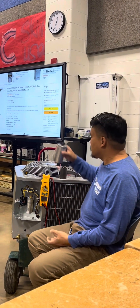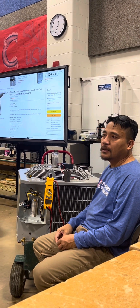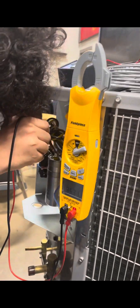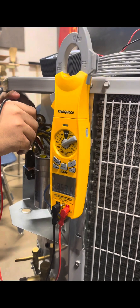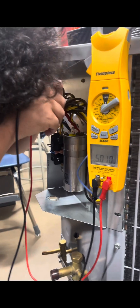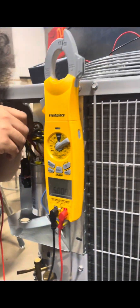Alright, so that's how you check. You guys are going to do it one by one. Go. What are you looking for right now? I'm with the compressor — common to HERM. What is the reading? It's 35. What is required? 35. Now going to fan — 5, exactly. Required. How much microfarad? 5. Good.